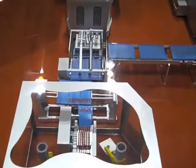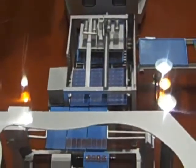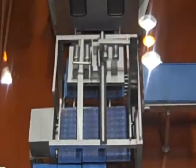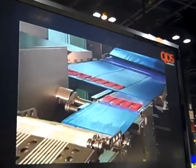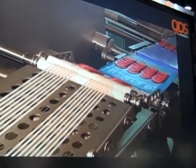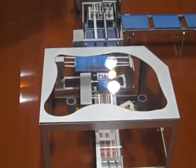After here, we take the last weight — we know exactly what is the weight of each one of the trays. We arrive to this station where there is a head with suction cups, one for each slice, which picks the product and displays it to the top of this belt. Then on this belt, we make a crossing movement — you can see it better on the screen in the video. The top of the belt starts to form the packaging size, and then you can have any kind of package you want.